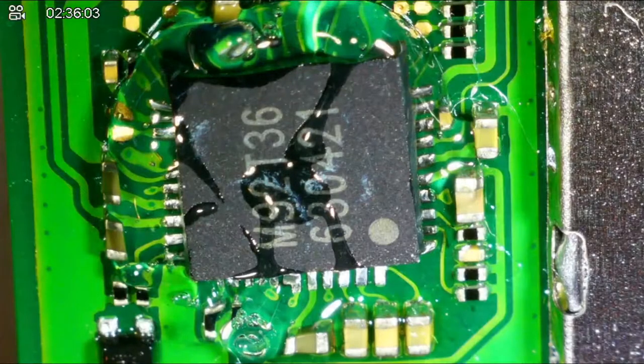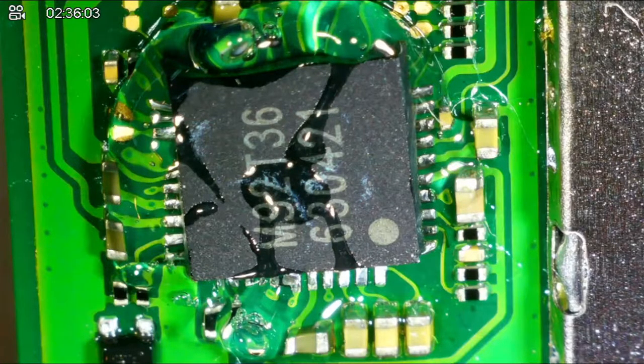Now, you recommend that. The pads are good. What I tend to use is a knife tip. I'm working on getting my soldering tips sorted out. I came unprepared to this. I'm going to use the same temperature at the same airspeed, I would assume, on this. Is that correct? If you're using 30% air at 420, tack the chip down and then ramp up the air. Okay.